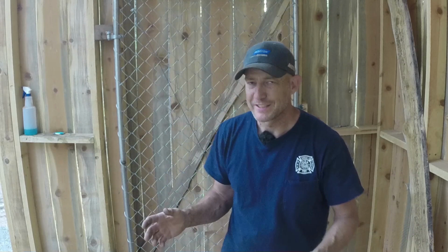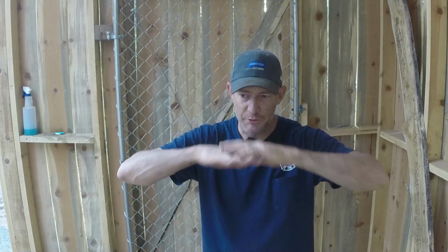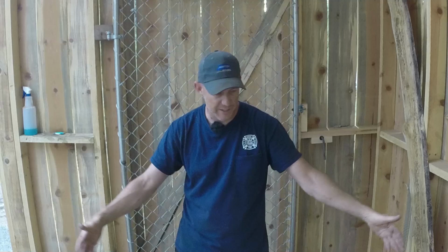And then I'll have about a week after we pour the slab. I want to wait about a week before I start tilting walls up on it. As you know, we want a very smooth concrete slab because that's going to be the inside floor of our house. And I tend to build my walls on the slab. I built my walls right in here and tilted them up. So I want to build my walls to my house on my slab. I want to let that cure real good so that when I'm moving those boards around, it's not putting light scratches in that concrete. I figure about a week, and then I'll start tilting walls up on the house.